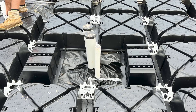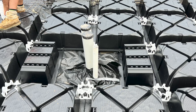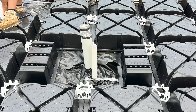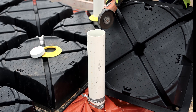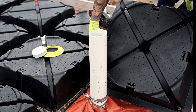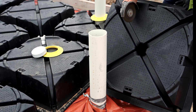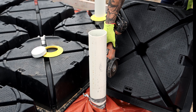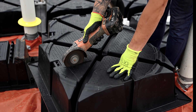Plumbing penetrations are either likely to land in the middle of the body of the primary pod or potentially in a rib. In the event that it lands in the body of the pod, using an angle grinder, cut a hole the exact width of the pipe itself so as to ensure a nice tight fit, which will minimise concrete entering into the body of the pod itself.